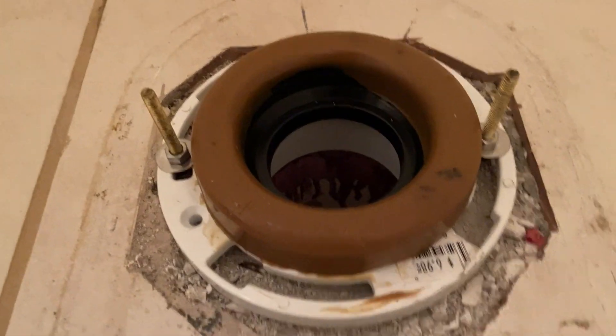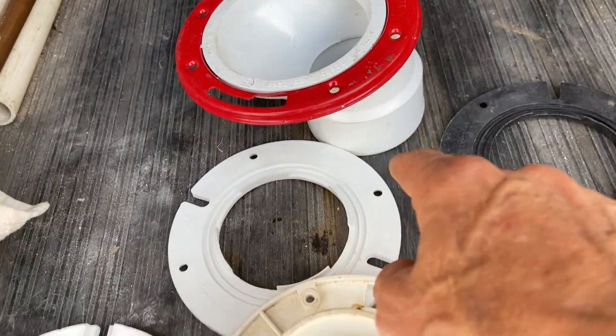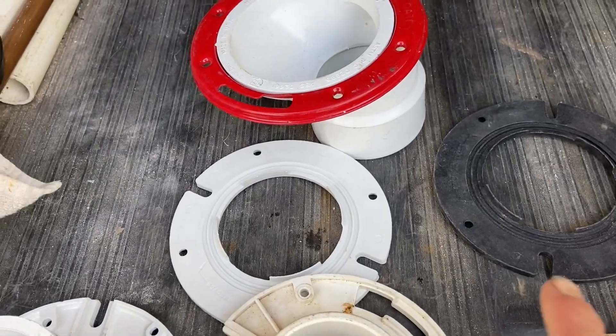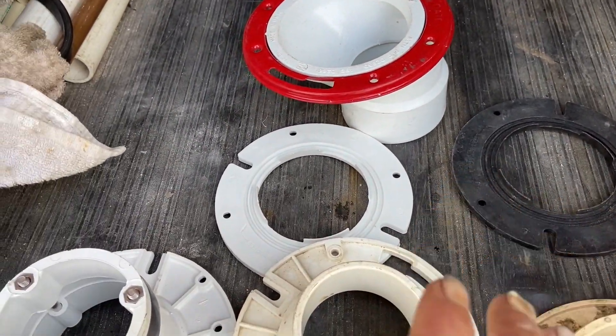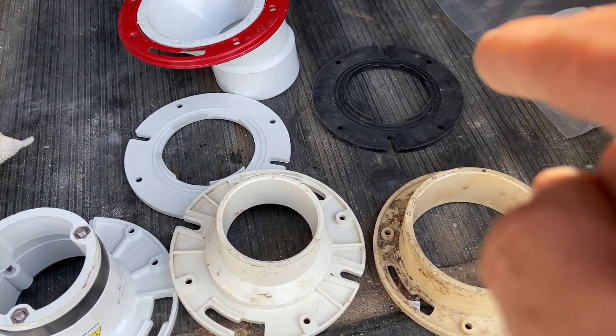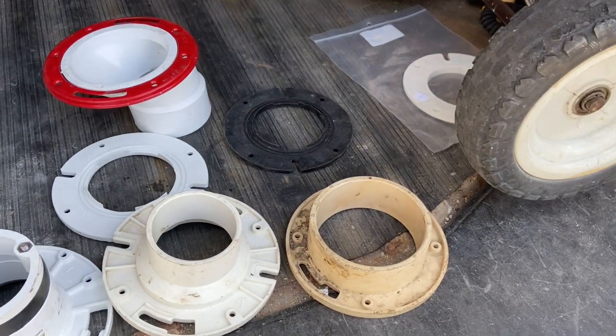I replaced a four by three PVC toilet flange. Now as you can see, there are so many different types of flanges — offsets, cast iron repairs, insets, over-sets — so the video you just watched is not a fix-all for all types of flanges. It's actually a three by four, which means it can fit over a three-inch pipe or inside of a four-inch pipe. Be mindful of that. Thanks for watching — leave any comments or questions below, don't forget to subscribe. Remember, not every toilet flange is alike. We'll show you other repairs in another video. Thanks so much — this has been Plumbing with Tim. Keep plumbing!